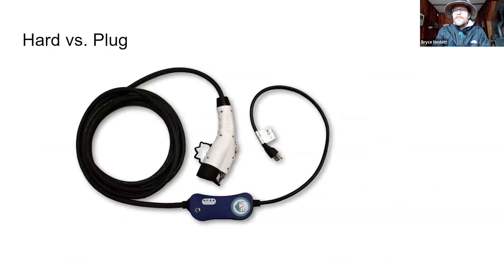What does an EVSE actually look like? The simplest possible EVSE might have come inside the trunk of a new car. It's got the J1772 plug that goes into the car, the EVSE unit itself — which is that big relay — and in this case just a regular outlet plug. As inspectors, you're going to be interested in where that thing is plugging into. If you see equipment like this in somebody's garage, look at that outlet — is it discolored? Does it show signs of heat stress? What breaker is feeding it? EVs treat electrical systems loud and hard.